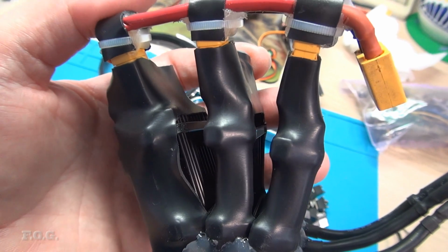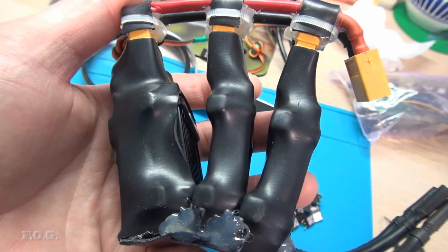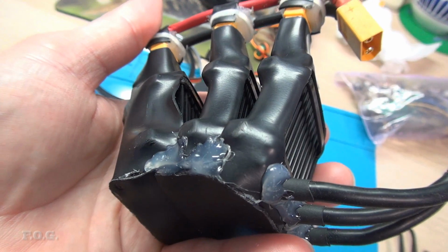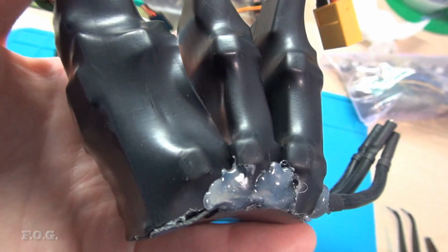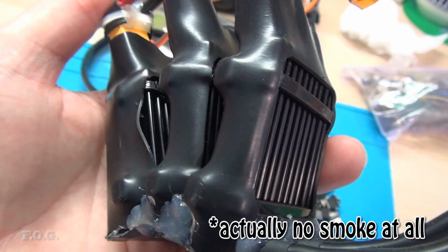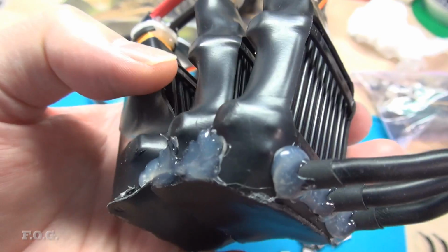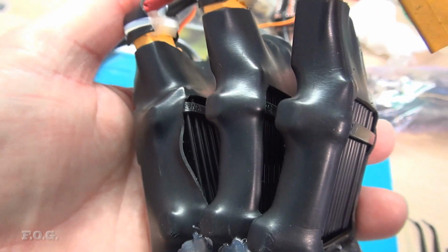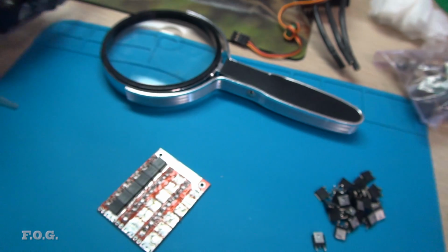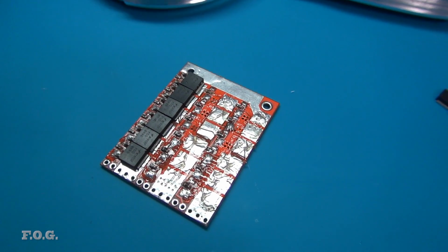And the good news was that the emergency stop, or the automatic stop, or the stall detect on the mini lathe software worked very well within about half a second, and there wasn't that much smoke, but clearly something is shorted out in the ESC because the power supply keeps shutting down every time the ESC starts up, which is what I've seen before. So I'm back to rebuilding another ESC,